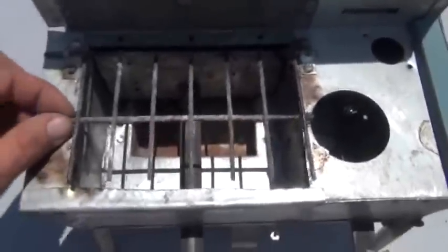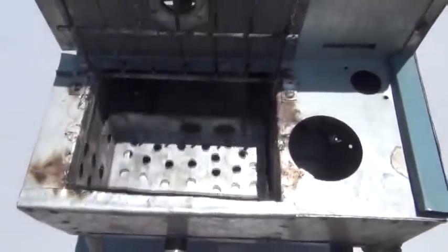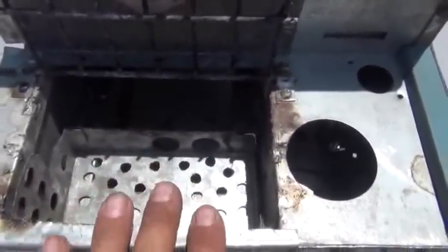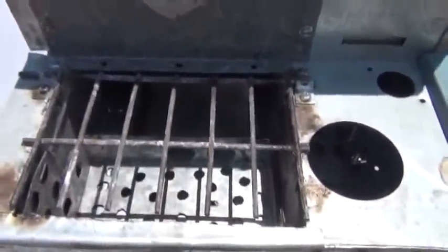Here's the little grill — you lift it up and it holds itself. Grab the biochar lever and pull the tray all the way out. You can see it's got burn holes all over the bottom and sides, giving a lot of oxygen to the biochar allowing it to burn completely and nice and hot underneath your grill. The back plate of this is higher than the rest — when you push that up in there it lines up right here with the front flashing plate, hitting the biochar dump lever perfectly. It all dumps nice and safe right in that canister.